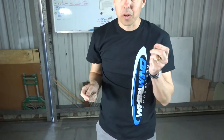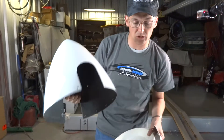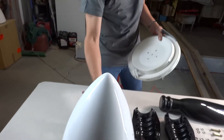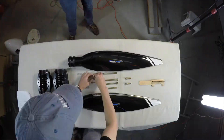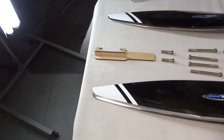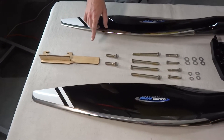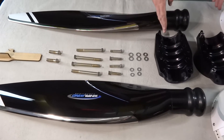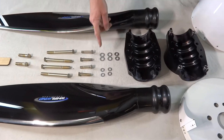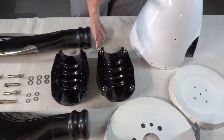Last on the list is four hub clamping bolts and their Nord-lock washers. Today we'll be talking about the RV 13-inch spinner, made up of the spinner dome itself and then a forward and aft bulkhead. To recap the parts list: two propeller blades, the blade setting angle paddle, the six bolts that hold the propeller assembly onto the crankshaft, the four bolts that clamp the two halves of the hub together with their associated lock washers, and the spinner associated with the specific airplane.